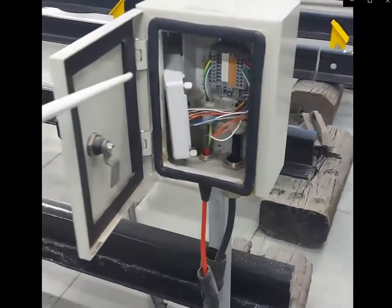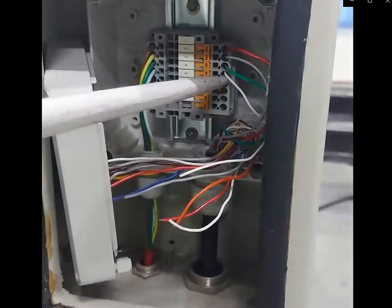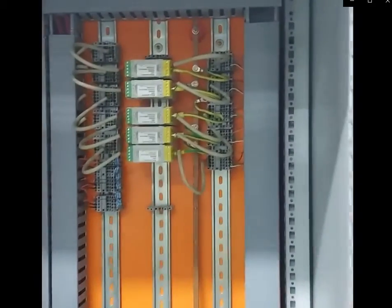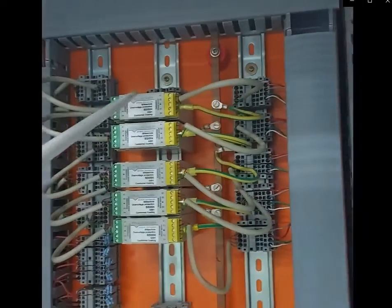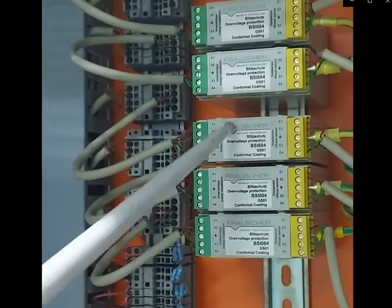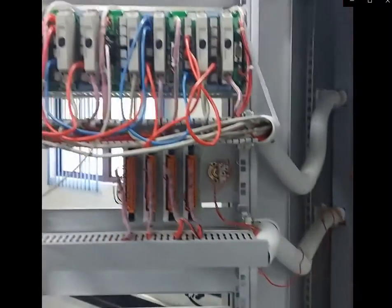The sensor tail cable is terminated at this JB junction box. Four conductors from the sensors are connected here, and the 0.9 quad four conductors are also connected here. This quad 0.9 cable is extended all the way to the indoor equipment, coming in the form of quad and terminating inside this cubicle in the indoor part. There it is connected with the Frauscher-recommended surge voltage protection device. Five sensors are terminated here with proper surge protection for five numbers, and from here the signals come to the termination of the input inside the processing boards.